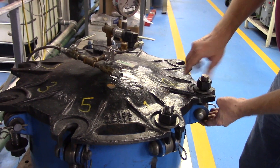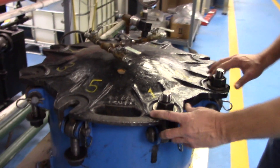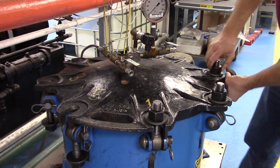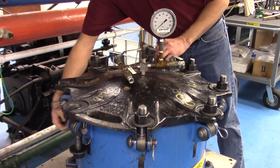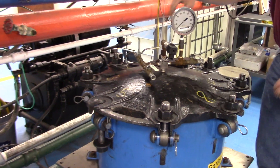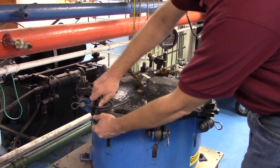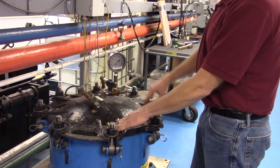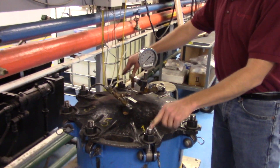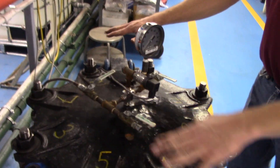When we bring the bolts up into place, you'll notice each one has a hard flat washer, which helps with load translation. On our manway here, you can see the numbering that exists on the manway lid — this helps us keep track of where we're tightening the bolts. We want to use a crossing pattern when we tighten the bolts to ensure that everything is evenly loaded.